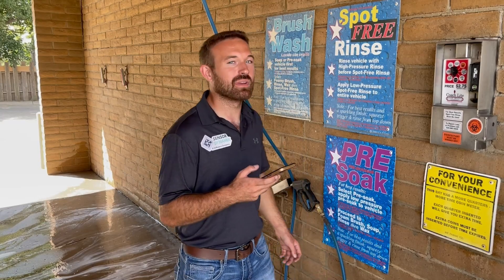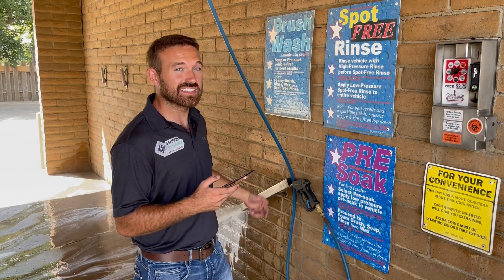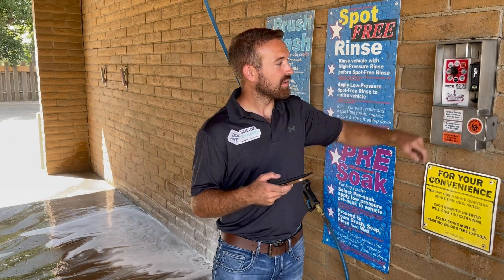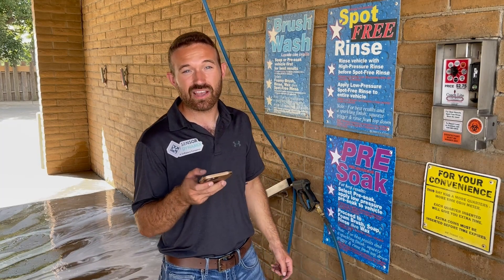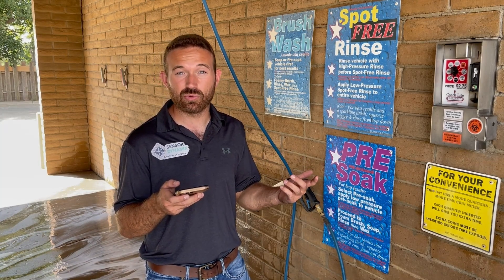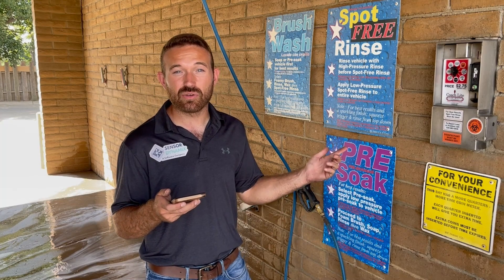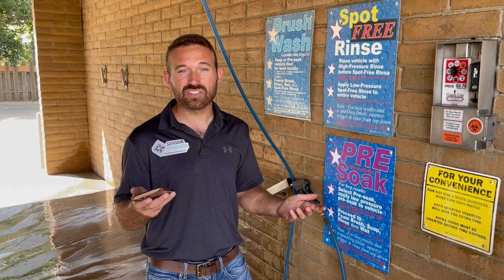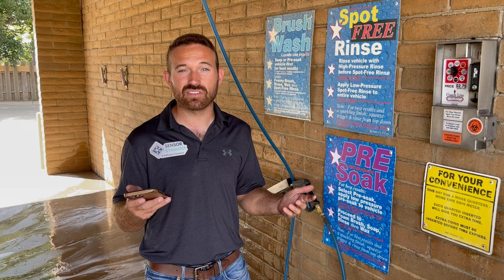Now with the sensor installed, we come out to the bay and use the sensor to read the pressure of the pump. Turn on the high-pressure cycle — the sensor will read the pressure and send the data to the app in a few seconds. Once your app lights up with the data, turn off the cycle and use that data to adjust your upper and lower thresholds. These thresholds are used for your instant notifications. If the data surpasses your upper or lower threshold, you'll get a notification. An upper threshold is used for a plugged tip or even a frozen tip in winter. Your lower threshold is your primary threshold — that's a cracked fitting, a blown hose, any type of mechanical failure, or even if the thermal overload has tripped on your contactor and your pump doesn't run. With all that information, you have your tailored, customizable upper and lower threshold series for notifications, and at any time you can go in and re-tailor those thresholds through the app.